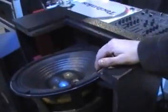Right. There's a big fat driver on this thing. Yeah, this is a 500 watt RMS driver. It's got a 4-inch voice coil, and it will play down to 38 hertz. Wow. Nice. And if you see the throat, the way it works, it throws the air around the horn and out the bottom. The main advantage to using a speaker like this is, if you can see down here, when you put them together, they work in tandem and you get what's called a 3 dB gain, which in sound terms is loads. Well, absolutely, that's double. Every 3 dB is double, right? That's right, yeah.